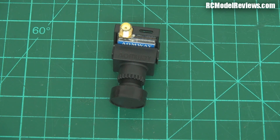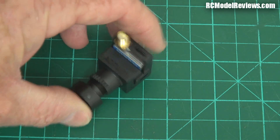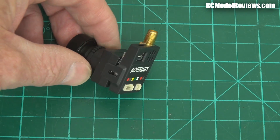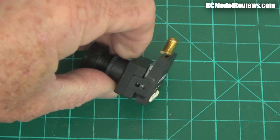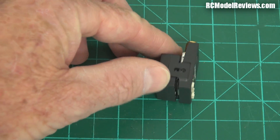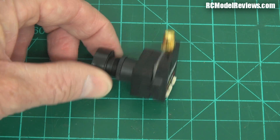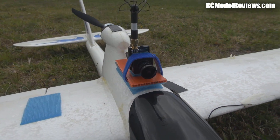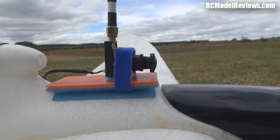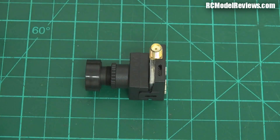They also sent me this — the very same camera but with the Aonway 200 milliwatt 5.8 GHz transmitter on the back of it. See how that fits together? It's like a video FPV backpack system, and it's brilliant. It's really small and quite compact. It still has the 2.1 millimeter lens for a wide angle view, and it's got an SMA connector. Worth noting that if you already have antennas, this uses SMA. I'm going to mount this on my AXN with a bit of core flute and Velcro, throw a proper antenna on top, and go fly it.